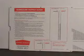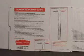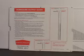During operation, you may find that you need more or less moisture. Sometimes cooler conditions or night ginning will call for temperature adjustments. A common mistake is to think that both temperatures must be raised or lowered together. A special tool is available to help you make and understand adjustments to the Humidaire temperatures. The Humidaire Output Guide offers an easy method of maintaining desired moist air output from the unit while reducing condensation.